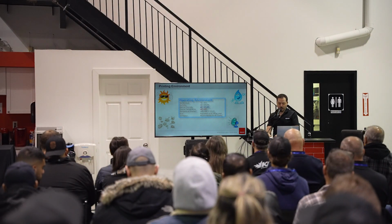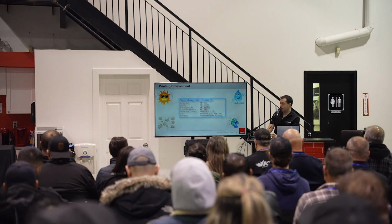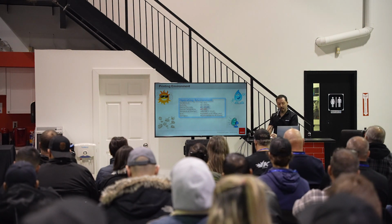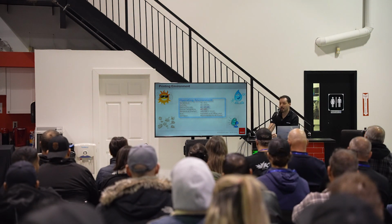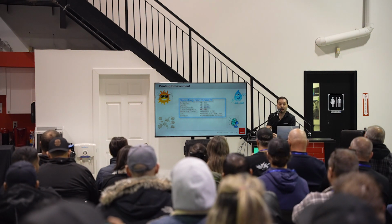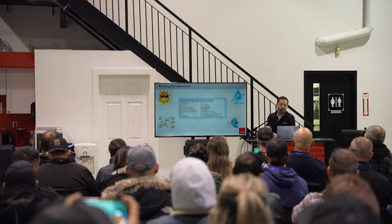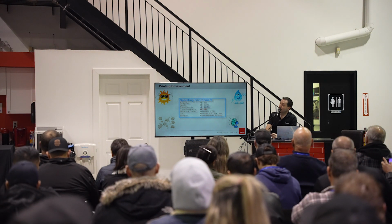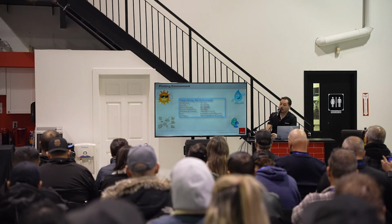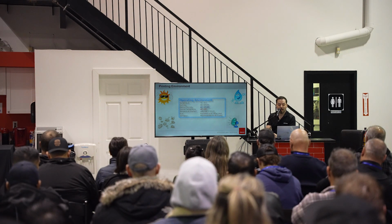All right, so first, really important is your printing environment. So you can see we've got some temperatures and humidity listed, 15 to 30 degrees. I would say that if you're at 15 degrees, you may still have some issues. Probably static issues, viscosity issues with the ink. Your humidity, 35 to 65. If you're below that, you're going to end up getting some static with your film, especially with the film. The backers tend to get a lot of static.